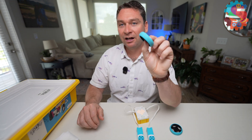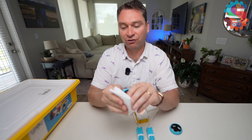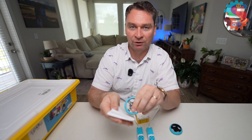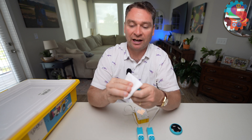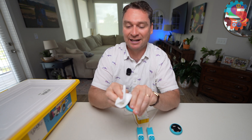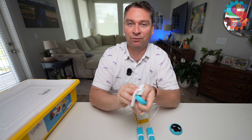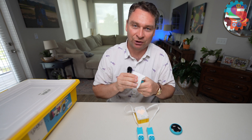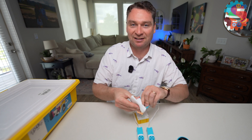And finally, the third thing: you can clean your wheels. Just get a damp rag and very gently rub your wheel against it — that'll take off a lot of the dust and dirt if you've been using your wheels in a classroom. We use Expo marker all the time to make lines for our robots to follow, so we end up with lots of Expo marker on the wheels. If you take a little bit of water you can wipe those off, and that will actually make your robot drive a little bit straighter so that the wheels have a fairly even amount of grime and grit on the bottom of them.